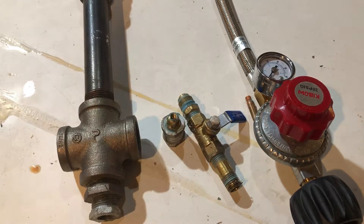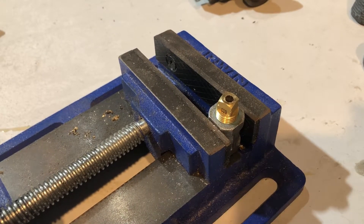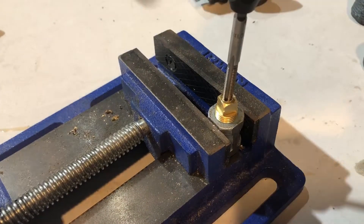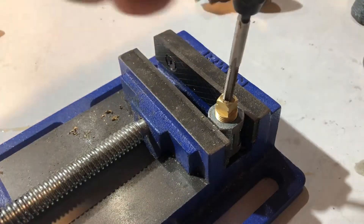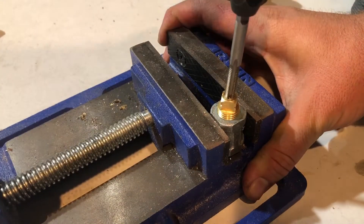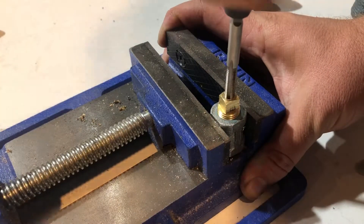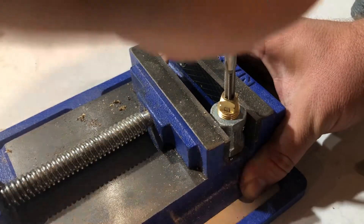I'll make another one so you can see how easy it is. I tried to drill it out by hand — it was taking too long, so I just put it in my drill. Using a number six tap, I thread it into the coupling that way so I don't damage the threads on the plug itself. If you've never threaded anything, it's pretty easy — brass is especially soft. Go until it gets a little tight, back it out, and thread it again. You're cutting threads — back it out to clear the way because you can break your tap even in brass.